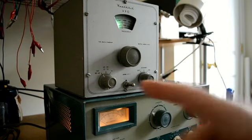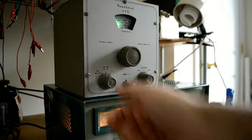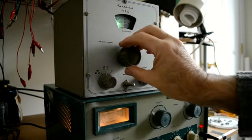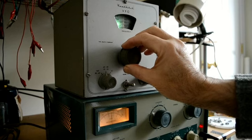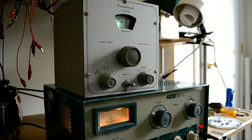We're going to move the switch over here because it uses slightly different circuitry. We're going to check that circuitry out on 40 meters. Okay, we are now on 40 meters. I need to have a steady hand. And we have about 2 mils of grid current there, and I haven't even peaked it up. Let's back it off a little bit. So that's on 40 meters.